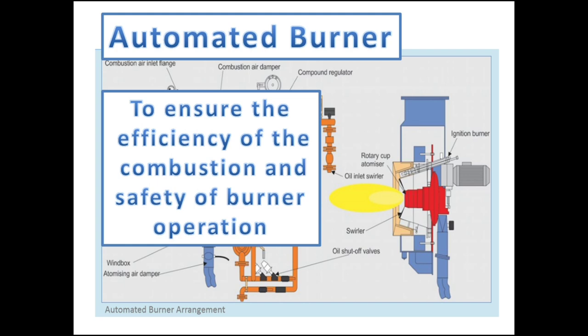and with correct temperature and viscosity for rapid combustion. This is to ensure that the fuel is at the right atomization that will turn the fuel into micro-droplets for efficient combustion. Temperature is a critical factor during combustion, as a lower-than-normal temperature will lead to an increase in the size of droplets, resulting in poor combustion and producing soot and smoke.